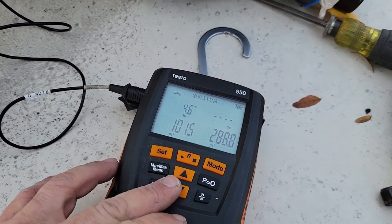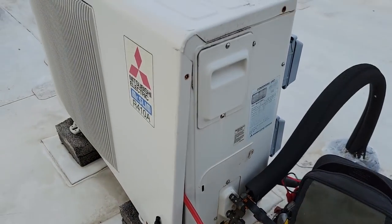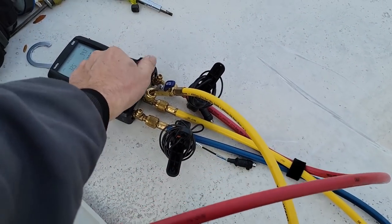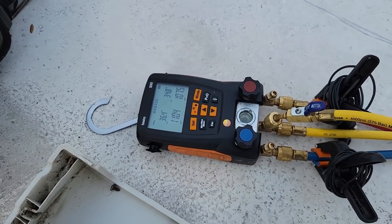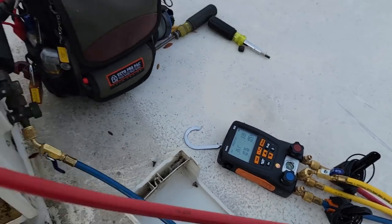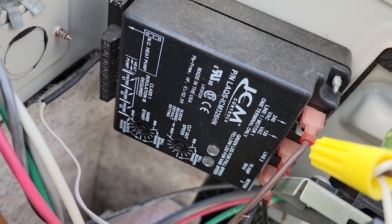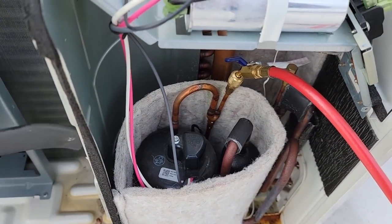She's doing pretty good. I'm going to say we're probably fine — I'm not horribly worried about that. We're going to get her back together and get out of here. I bleed my hoses all the way to the yellow to make sure I don't get anything trapped in the manifold. We're dumping refrigerant back in, not losing anything. Then we'll shut her down, disconnect, and get it all back together. That fan blade just barely taps the shroud as you pull it off — be really careful. I checked all those fittings down in there, did not find any leaks at all. Everything looks pretty good.